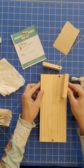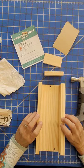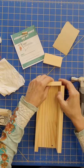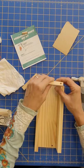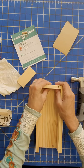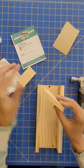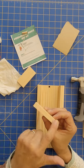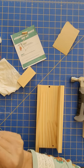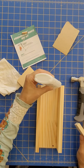Two nails in — that's enough for the bottom. Now we are ready to put in our ends. So remember, this is the bottom, and we wanna make sure that this hole goes up on the top. I'm gonna put a little bit of glue on the bottom here. I'm also gonna sand this because I can see there's a little bit of machine marks from the table saw. I'm gonna sand it nice and flat and blow all that sawdust out of the way.